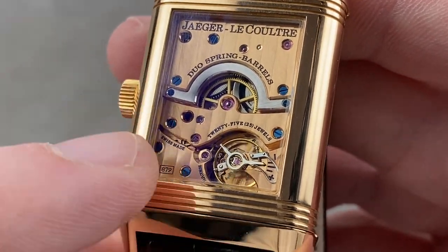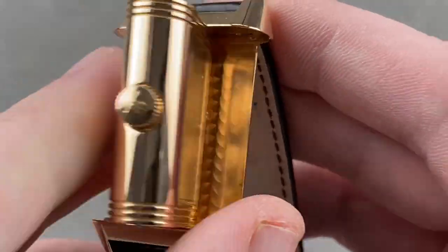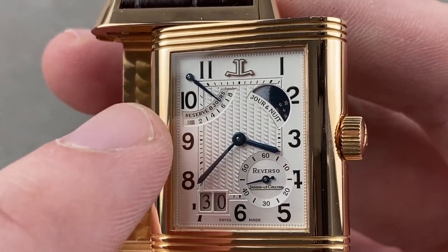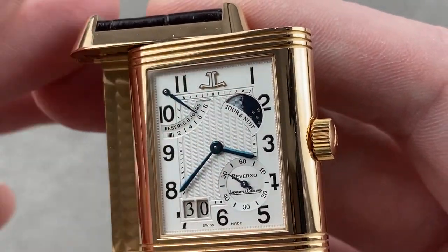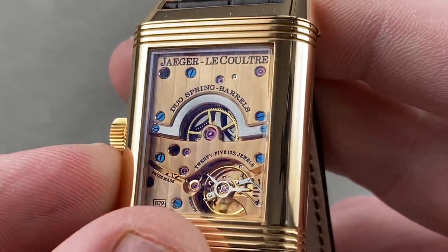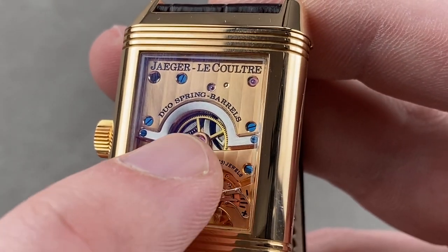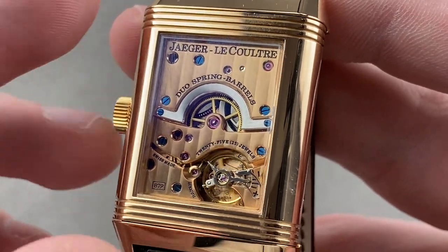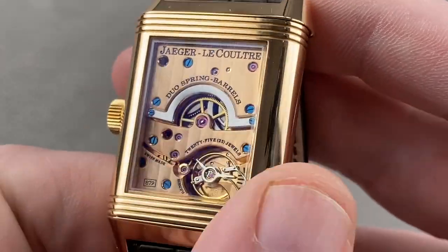The watch still has a modern beat rate — 28,800 vibrations per hour on the bridge adjacent — and it has two mainspring barrels. The power reserve as rated is eight days, with a power reserve indicator on the dial, but in truth it will run to exhaustion finishing just short of 10 days from a full wind. There is also a double-digit date with a quick set and a day-night indicator, and it winds quickly: 55 turns to energize the twin mainspring barrels. The timepiece features glorious hand finishing: anglage, Côte de Genève, engine turning, satination on the wheels, and work within the wheels. The center wheel has chamfered internal circumference and spokes, and fired blue screws with a black polish to fine adjustment mechanism on the balance itself. The watch features a lovely set of contrasts — silver, rose, yellow gold of the wheels, blue of the screws, violet of the pivot jewels — all of this in caliber 879.